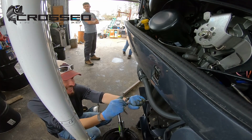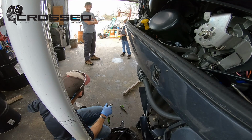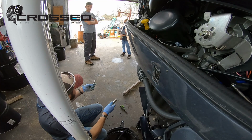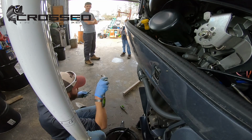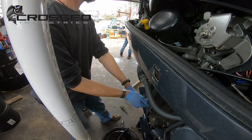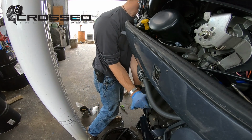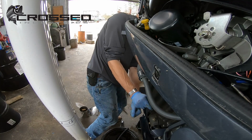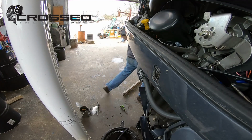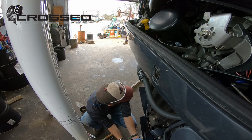In the new two strokes, there's not much difference because we don't burn the oil in the motor when we're running it. In an older two stroke, you burn gas and oil together and it would go all over your motor and mix all over the place to lubricate and make the motor work. In new two strokes, it's like a four stroke. Gas goes bang and oil lubricates on the backside. That's where the direct inject comes from. So HDPIs, the older Pro XS's for Merc, the two stroke versions of it. And the E-TEC, the precursors were Ficht and Optimax. OMC actually patented both of them, sold Mercury Optimax, kept Ficht. The way you pick up water and run it through the block also changed the dynamic of performance too.